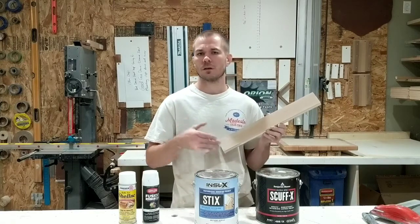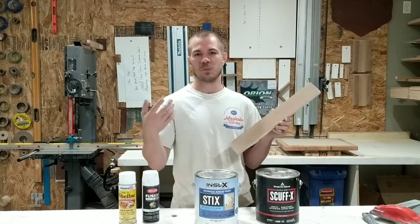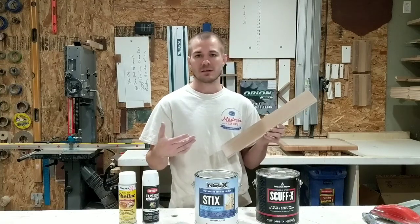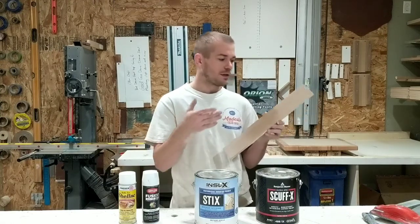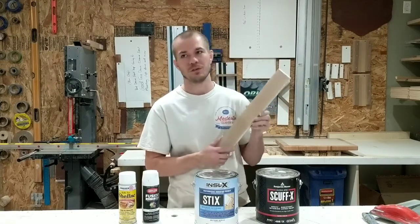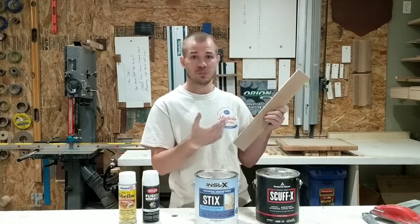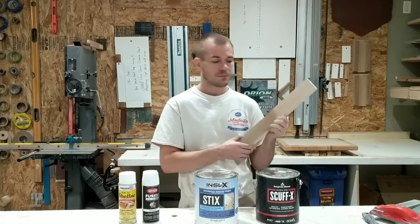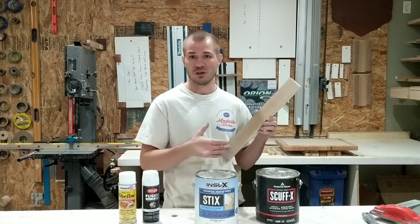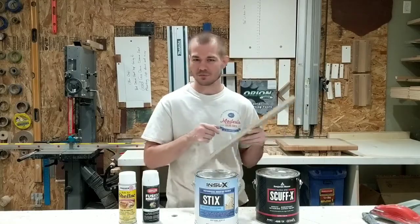Now I did a video a little bit earlier about super refined MDF and does it suck? And spoiler alert, no, super refined MDF does not suck. It's a great product. And a lot of the times it can be just as durable as hardwoods. Now Medex, what we're using today, is a water resistant super refined MDF. Super refined meaning the edges here are going to be able to be sprayed and finished just like the faces. And this stuff is going to give us a surface quality once painted that's as good as any hard maple or a beech. And without further ado, let's get into the spraying.